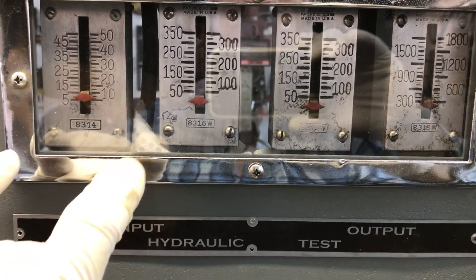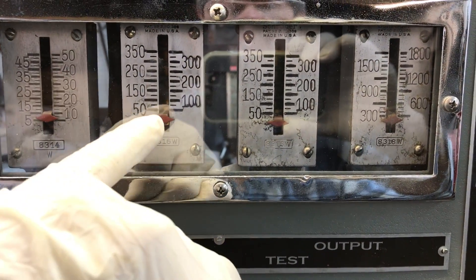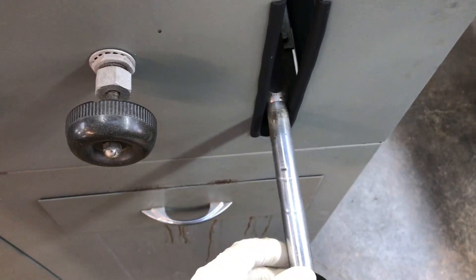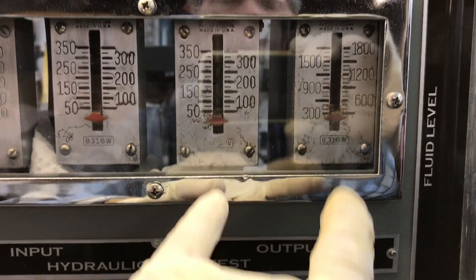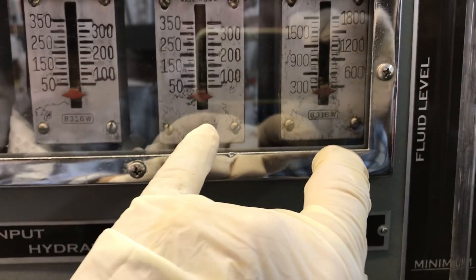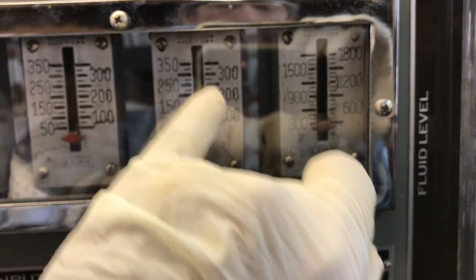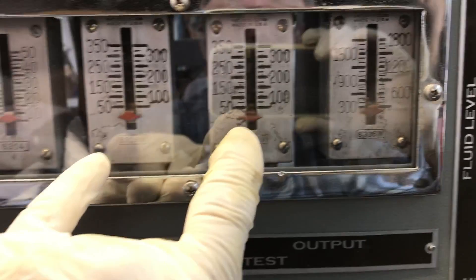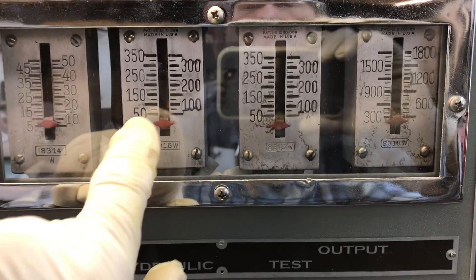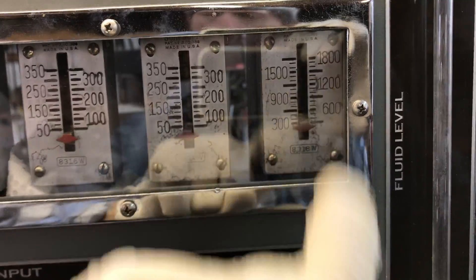What we're going to do is check our actual hydraulic pressures. On this side we have the input — these two gauges are tied together. This gauge goes up and maxes out, this gauge goes up and reads final input pressure, which is a two-to-one boost ratio. So whatever this reads right here, we're going to read twice that on this scale right here.